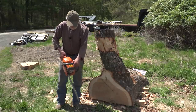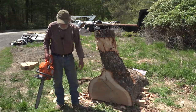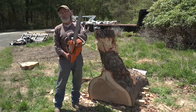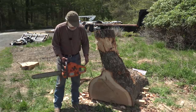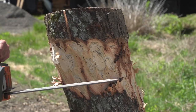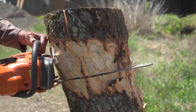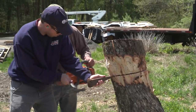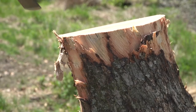The other thing I would never do is start it holding the handle like some people do. When you start it up and rev it up, if you're moving twigs or branches around, you might hit a twig or little branch and you're not strong enough to stop it when it comes up. You want the saw balanced with your hand close to the center line of the chain, then use some momentum to pull the cord. When my saw is sharpened like this to rip only, a cross cut can be a little bit difficult because it's unforgiving - it's cutting very, very narrow. At the end of this cut it started to bind a little bit, so we placed a wedge in the first part of the cut and opened it up just to finish it off, because the saw doesn't have enough power to get itself moving once it starts binding.